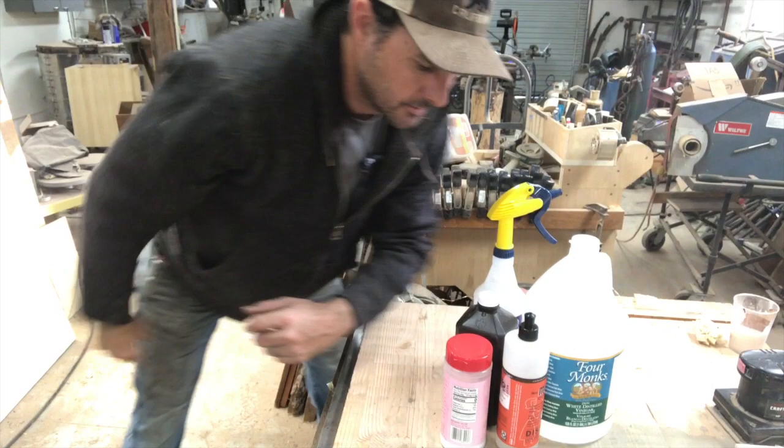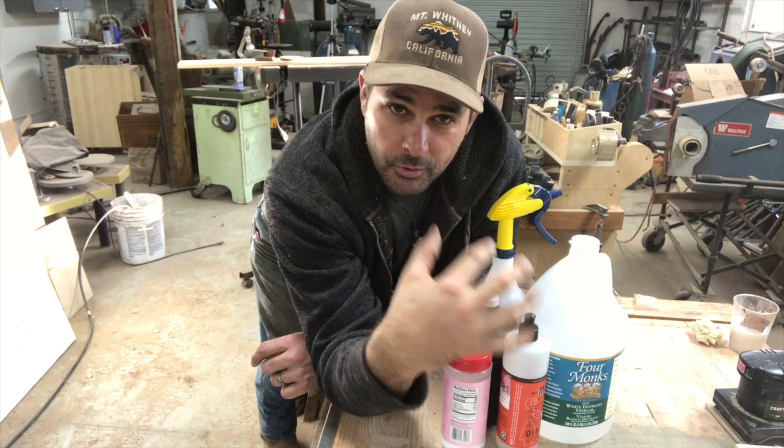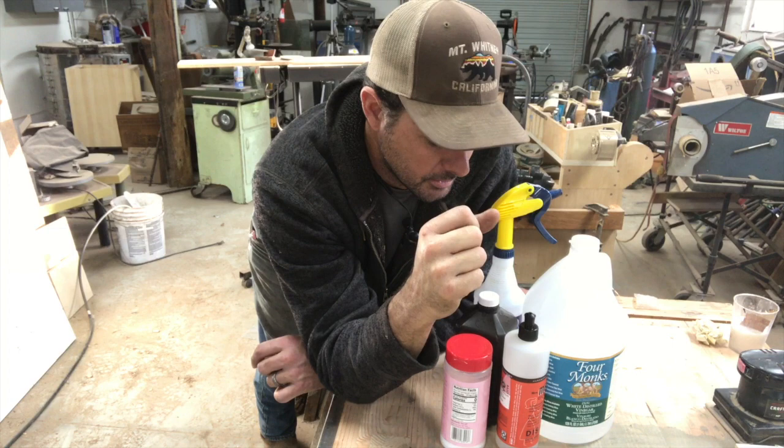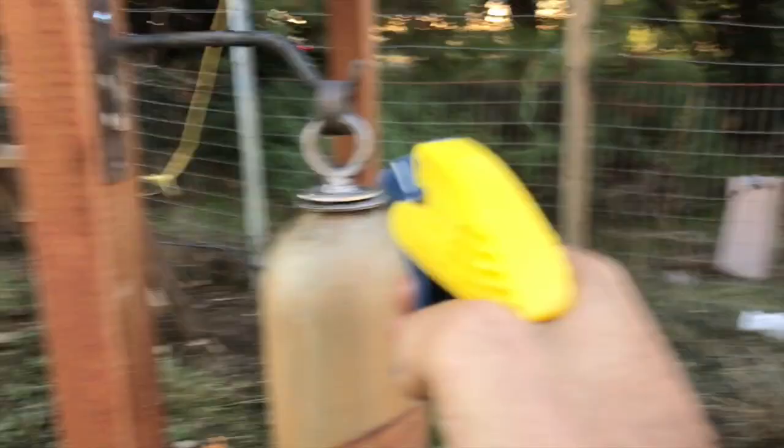What I'm about to do is show you how to rust metal quickly. This will put a nice rust patina on steel very quickly — in a few days it'll have a nice orange to reddish rust color to it. The best combination I've found for that is vinegar, a little bit of dish soap, salt, and peroxide. I'm going to show you how to rust this up — this is the solution we had mixed up. We're just going to squirt it on here, and you'll see this thing already starts to transform right before your eyes — it's already starting to get a patina on it. See that rust forming already?